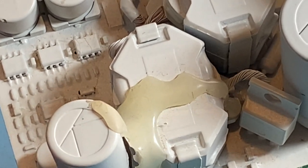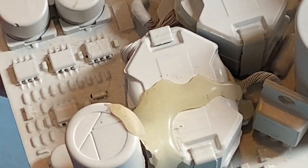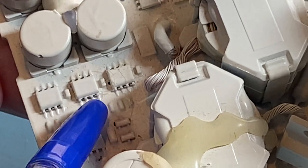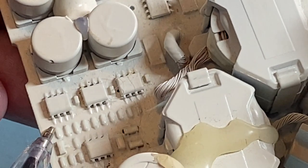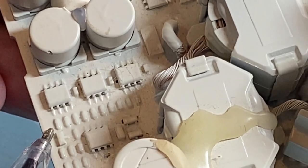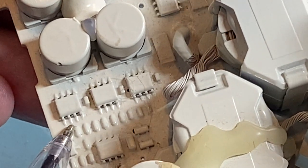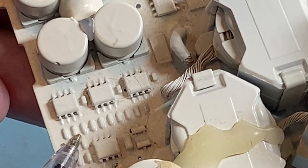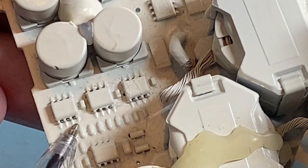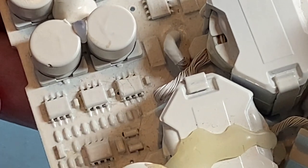You know, you can heat it up and cool it down, but if the pad's not touching or the resistors come adrift. Sometimes the plating on the end of these resistors, I know they just look like white little specs, but the plating through thermal cycling can come off the carbon body or metal film body, whatever type of resistor it is.